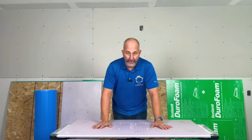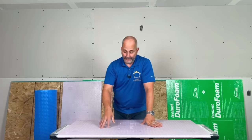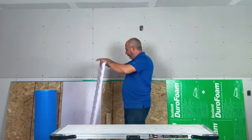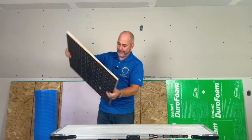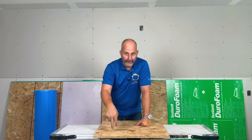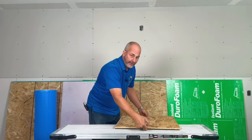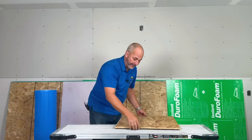It's a very dense rigid foam and you can put your flooring directly on top — but it has to be a floating floor: vinyl, laminate, or click-lock engineered hardwood. If you want to nail down engineered hardwood, the folks at Dricor have told us you actually have to add another layer of 5/8" OSB, because this panel isn't thick enough. The distance from the panel to the floor is not enough room for the staple. That's the engineering problem — if you want real or engineered hardwood in a basement nailed down, this panel isn't sufficient by itself; you've got to add another layer.